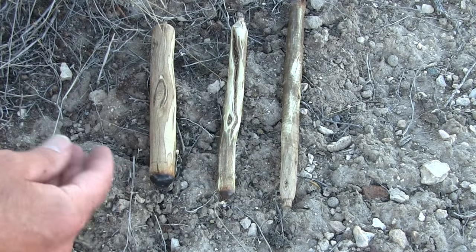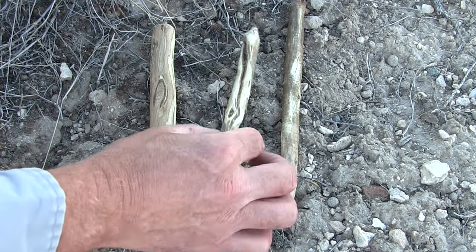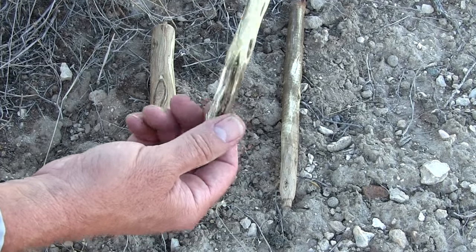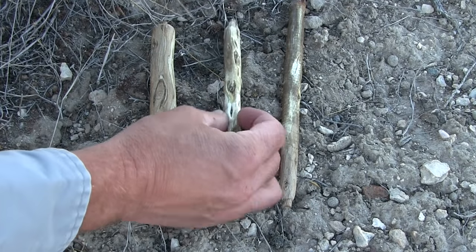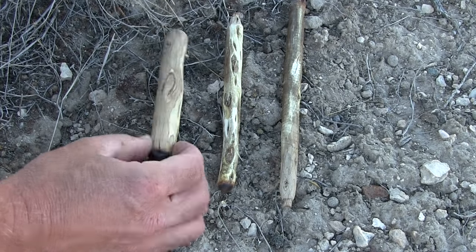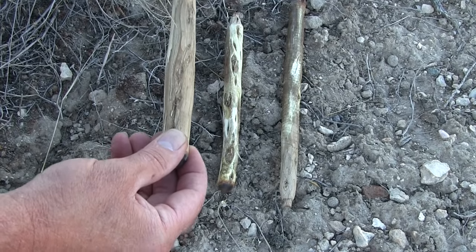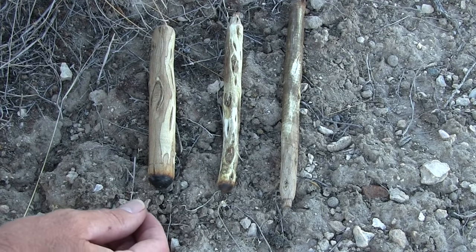The diameter of your spindle is like gearing. If it's too small, it's like a very small cog on the back of your motorcycle — it's probably not going to have enough power to go down the road. So give yourself a little gearing advantage by having a slightly larger diameter spindle. That'll keep it moving even if it starts to get sticky and wants to jam up.